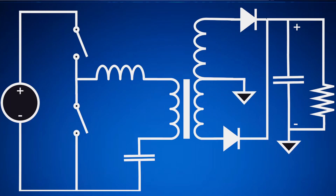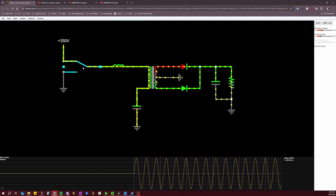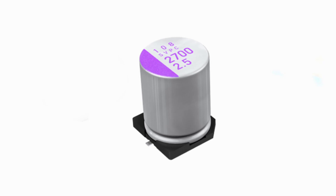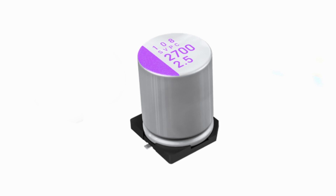The last component is the output capacitor, whose purpose is to smooth out the ripple on the output voltage waveform and provide a clean DC signal for the load. When selecting an output capacitor, key parameters include the voltage rating, capacitance value, equivalent series resistance (ESR), and ripple current rating. Typically, an aluminum polymer capacitor is used in LLC Half-Bridge applications because it offers high ripple current ratings at high switching frequencies as well as the low ESR required.